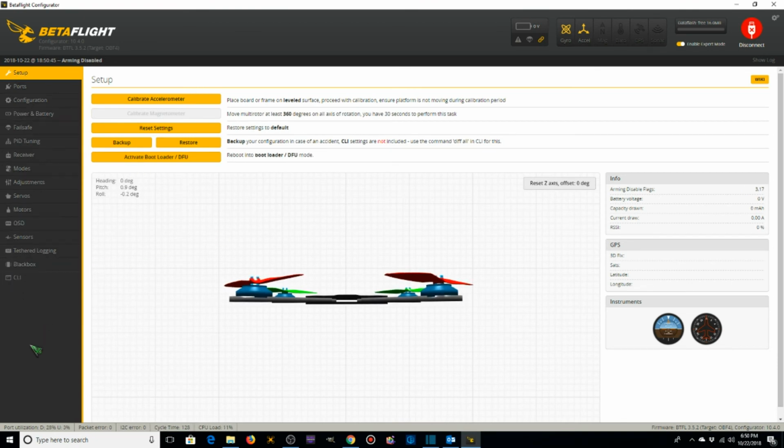So the next thing we're going to do is check to see why motor number 2 is not working. It could be solder joints, so I'll take a look at those. It could actually be that we got a bad motor, which, if that's the case, fortunately when I purchased these motors, instead of getting 4, I got 5 spare just in case, because a lot of quadcopter parts come from overseas and take 3 to 4 weeks to get here. So instead of 4, you want to get 5. Get a spare of everything that you can, just in case you get a bad one, or you happen to break one.